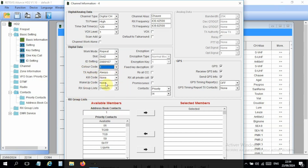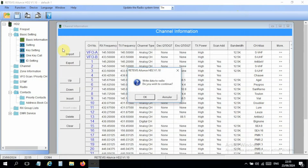TX authority set to 'always'. There is a radio-kill feature but that's for commercial applications, so I'm not touching it. GPS I clicked yes on those three boxes, but I didn't enable automatic position reports. That's essentially all you need. It may seem complicated at first, but once you have the frequency, time slot, and color code from the repeater, plus the correct talk group assigned in your priority contacts, you're set. Then I write the configuration to the radio.